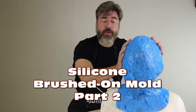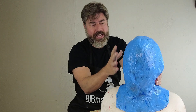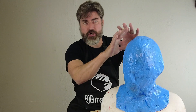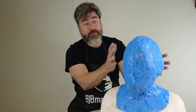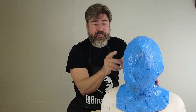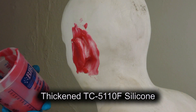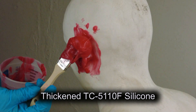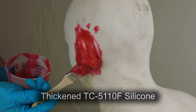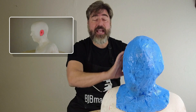We're back for part two of our simple silicone brush-on mold. This is a unique approach because normally I would do this all in one homogenous brush-on mold of 5130F through all the different coats. But in part one, we used a soft silicone on just the ears and then built up everywhere else with the 5130F. So on the ears we have 5110F, which is a fast-setting, very soft, around a Shore A5 silicone. Everything else is the 5130F, which is around a 25 Shore A.